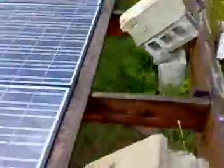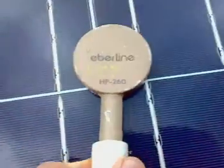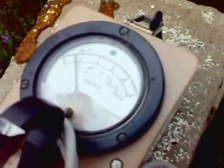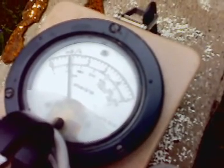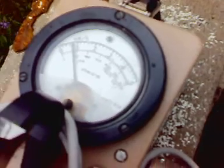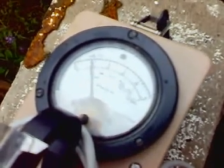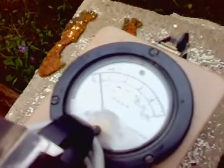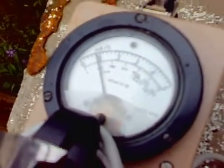We're going to go with another panel that has not been wiped ever for many weeks. I'm just going to put the probe against the panel. You're going to see a slightly elevated background, but not really — sometimes it's like 100, 150; I've seen up to 250, 300. You can tell that there's radioactivity there, but it's all spread out over the panel, over the glass. What I'm doing with the paper towel is concentrating and collecting it. People who go around with their Geiger counters just putting the wand to a surface — it doesn't look very radioactive. But when you wipe it, you concentrate that whole surface area into one little area that the Geiger tube can pick up, and then you start seeing really interesting counts.